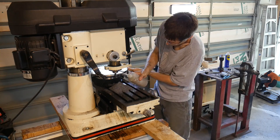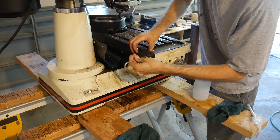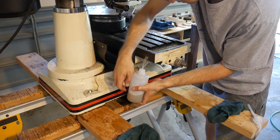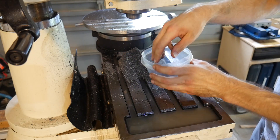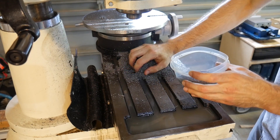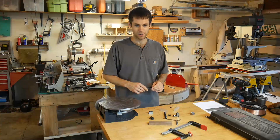I can still feel it in my arm — it's been a couple of days. I used a lot of coolant, and it was accumulating in the bottom of the table. There was a set screw so I was able to drain it out and reuse some of it. Flood coolant would have been handy because it was steaming away. There were a lot of chips piling up — I grabbed a good chunk of them for magnet experiments. I weighed those and they were 2.5 pounds, almost a kilo, and that was less than 50% of the chips I created.